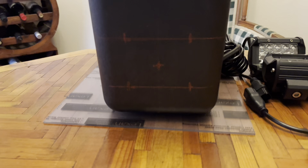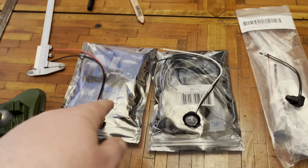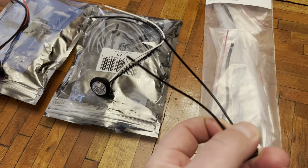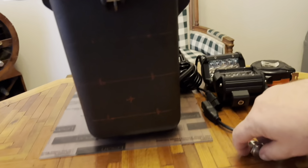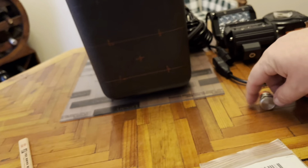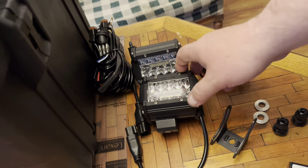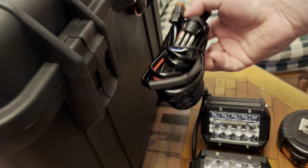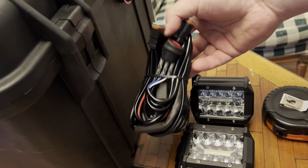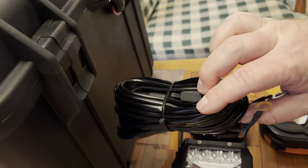You can see I've already got it marked out here. The bottom four outside holes are going to be one side red, one side white. The middle is going to be a simple bulkhead on-off switch, inline positive. On the top of one side will have an on-off and a master DC switch. The on-off switches are going to power these 60 watt LEDs. I've got the wiring harness for that — I'm going to cannibalize this and just use what I need out of it, but I am going to use that relay and maybe the inline fuse.